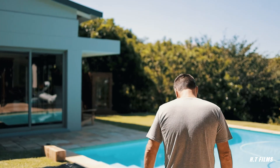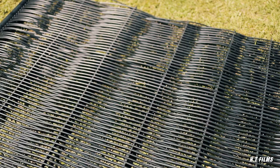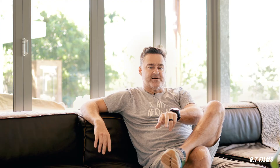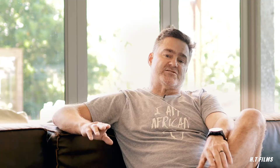We get this question quite a bit. There are three main panels on the market at the moment: the single density panel, the double density panel, and an EPDM panel. The first two — the single and the double density — are your traditional spaghetti-type panels. The single density panel has only 70 of those riser pipes, while the double density has 140.